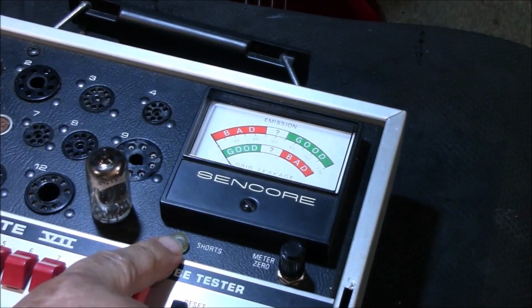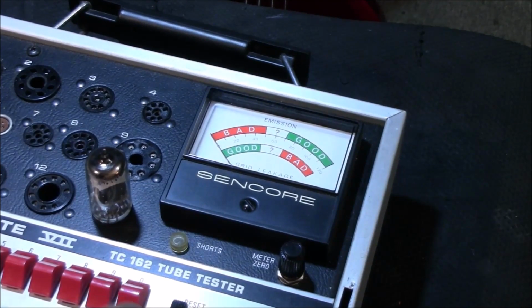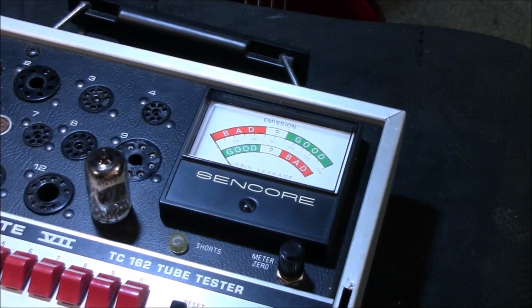Now what we're looking for, guys, on this little light here, it will stay on when I move through the pins, okay? Won't flicker. That's not a problem. See a little flicker? No problem. It's got to stay on to show me a short in those pins. All right, 67. One more time. Goes back to 8 on D. And it's on 8.